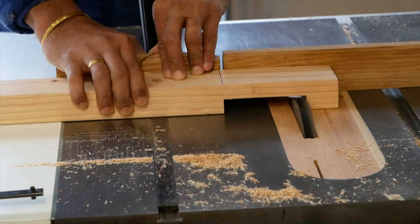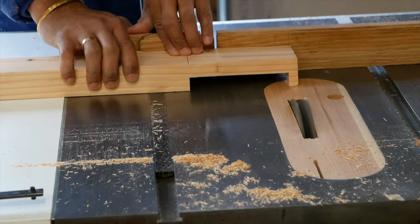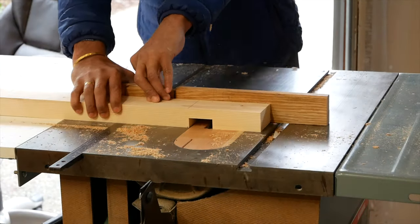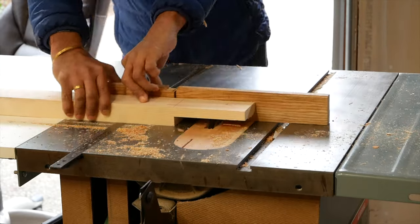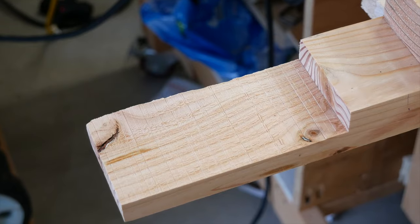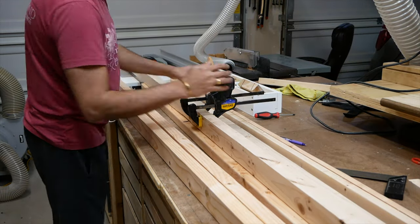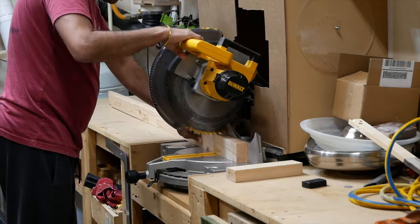In our first screen video, we made the whole thing with just a miter saw and a drill, so for people with limited tools, that's also a great video to check out. This is how the dado turned out. After cutting all the joints, we temporarily clamped the boards together and marked the board to full length, then cut them down to size at the miter saw.